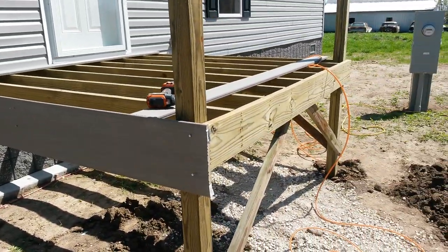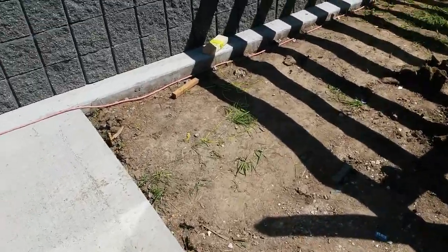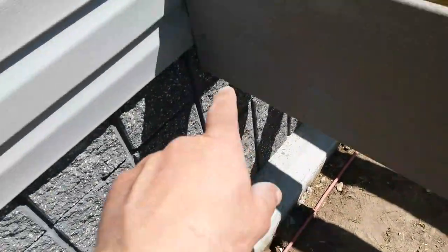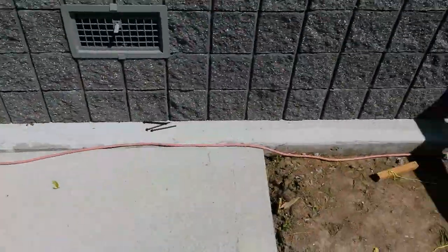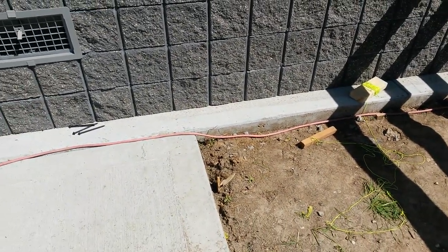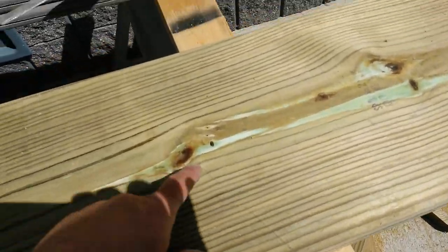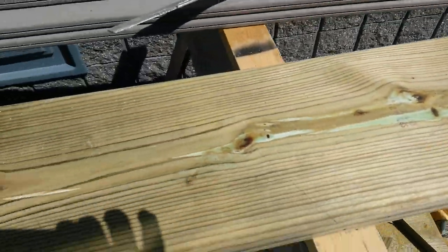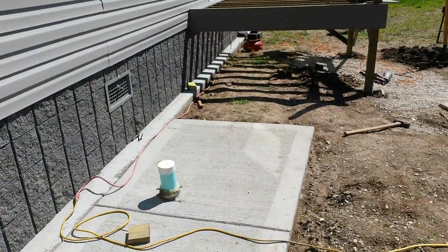Making the stairs here - from this concrete, which is level with that, from there up to here is 38 and a half inches. I took that and divided it by six and it didn't come out right, so I divided by seven and it came out to 5.5, which is five and a half inches. That's what I wanted these to be - a little easier to step on. Five and a half inches is really good, so it's going to take about six steps to cover that span.